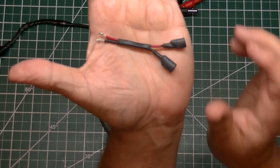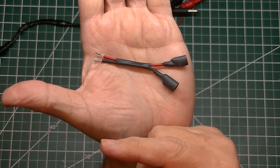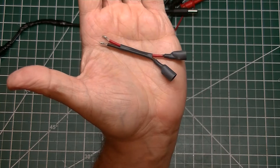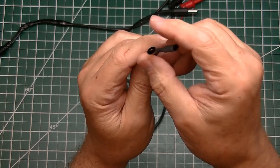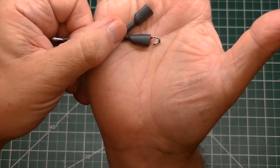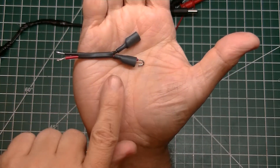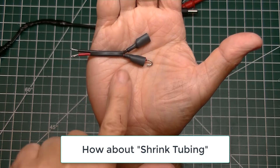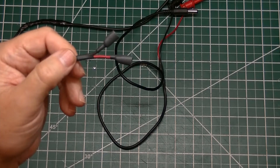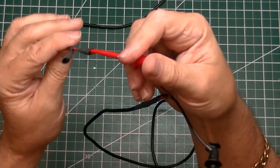The other cable is a short cable with soldered ends at the exact length necessary to go into the screw terminals on the buck converter. They're soldered with a little extra solder to make the wire thicker so they fit more securely. On the ends I made little J-hooks with additional solder to make them solid rather than stranded. Then using shrink wrap — holding it while applying heat — I put little covers on there to prevent the clips from shorting out, so you can clip on safely. These are my Geek Must-Have special pigtails.